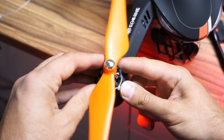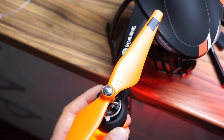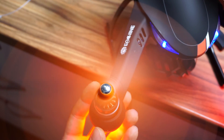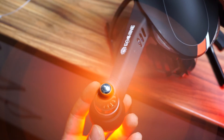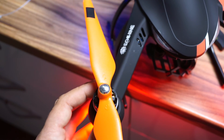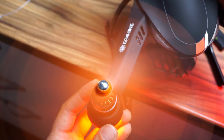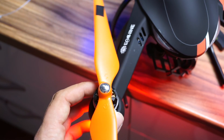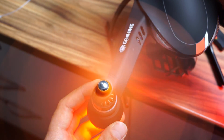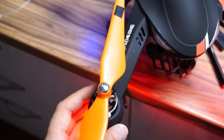That way you don't need to remove the zip tie. You can use electrical tape instead of a zip tie, but I prefer the zip tie — it's easier. It's easy to do and you can mark where the zip tie should be, and if for some reason it moves, you can always bring it back. Do those fine adjustments. At some point, if the motor is too big or too imbalanced, you may need to add a second zip tie. Don't be afraid to do that, as long as you can balance both prop and motor together. That's how I did it on the Pioneer E350.